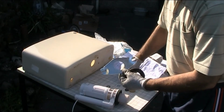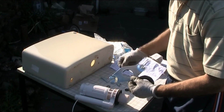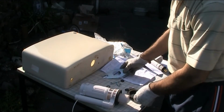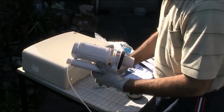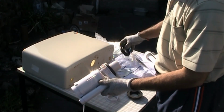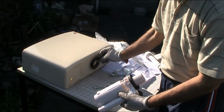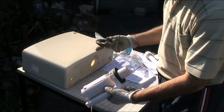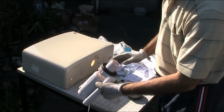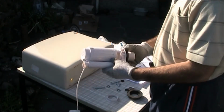So that comes with this plate, 2 bolts, 2 wing nuts, and washers, and also a donut washer, if you call it. And this one comes with a different type of ring seal as well. This is for a bigger hole cistern, so this is an extra seal. You don't need that for this cistern. It's already got one installed. If it was a bigger hole, I would take this out and put that in. Now we don't need that.